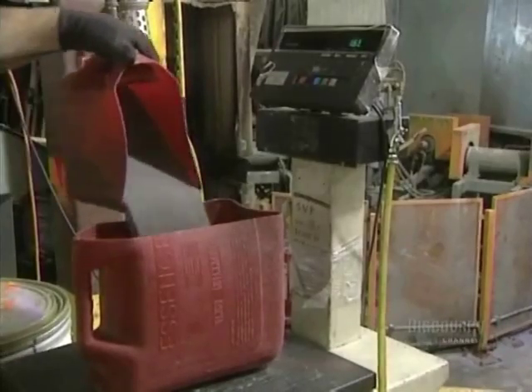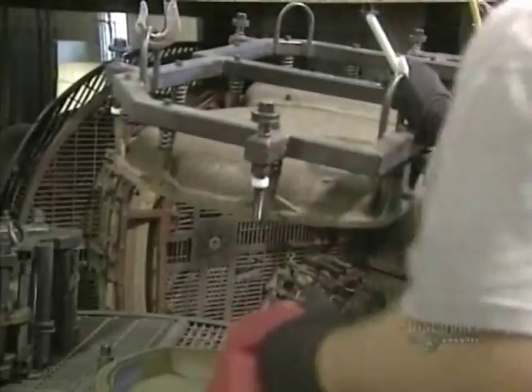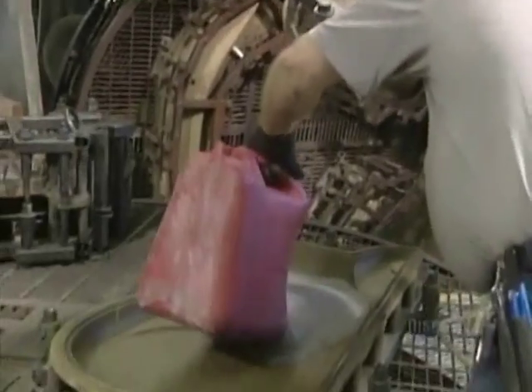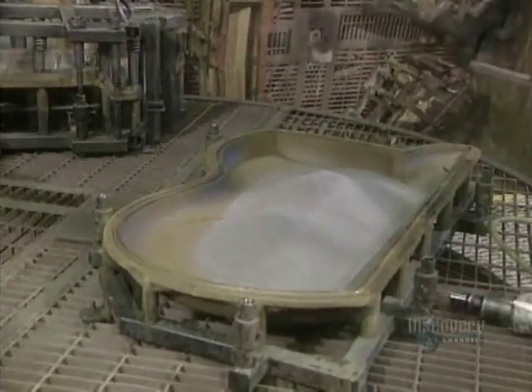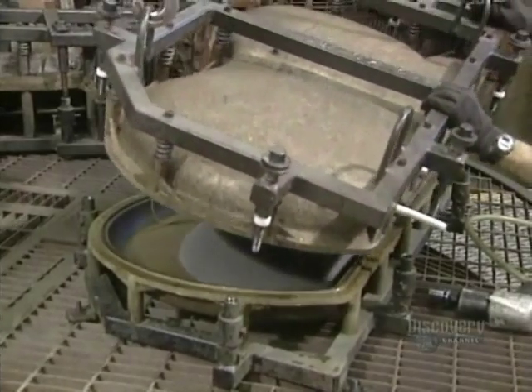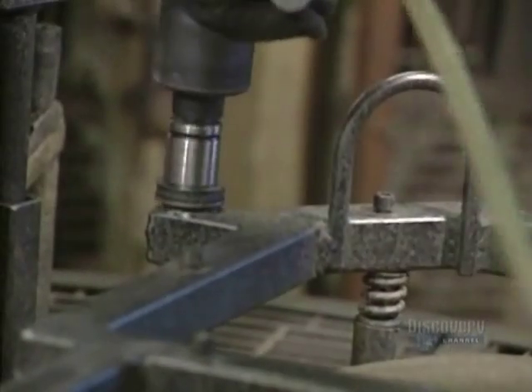This previously colored powder has a 35 mesh size, which is just a little larger than flour. Low-density linear polyethylene is poured into the bottom of the mold. The mold has a cover, which will be well closed, then placed on a steel support.